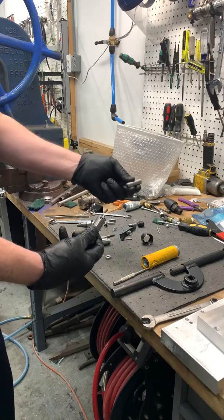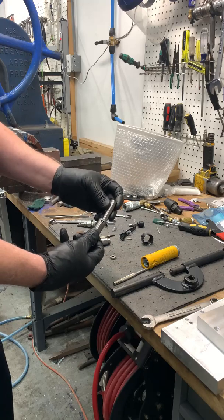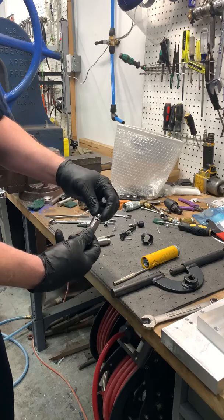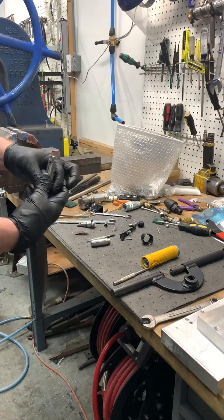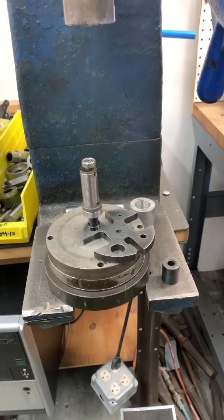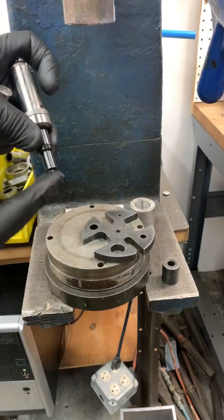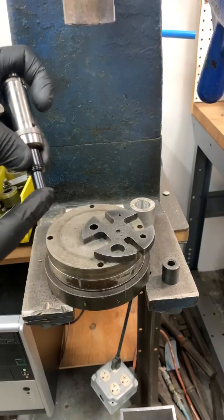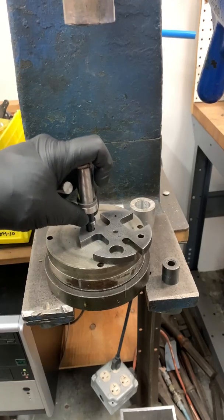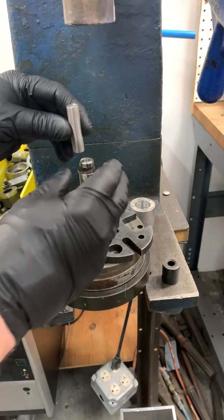And then you use a mandrel to push the inner race of this small bearing. Be sure your mandrel clears the shaft and touches the inner race only. So when you press it, you press the inner race. Okay, so here's the setup on the press. And normally I do not press on the bottom of this collet adapter because it'll crunch it up, you won't get a collet in there. I have a plate that has a hole that it sits straight down in. And you just press it down.